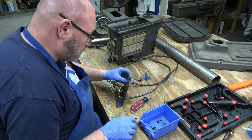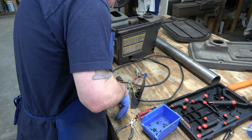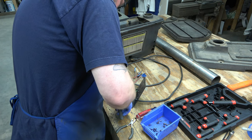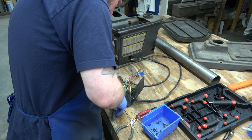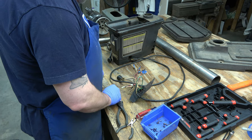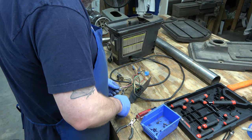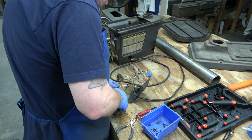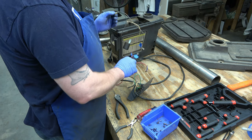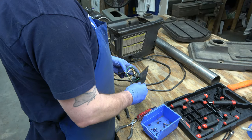There was a washer that I needed to knock loose. To really disassemble it any further, I had to cut off these crimped-on terminal covers, which I'm doing with a pair of dikes. But again, if you don't have to do this, don't do this. If you're going to repaint it and really rebuild this drill press, then have at it. Just make sure you've got those pictures so you can put it all back together, because it's a hot mess of wires and if you get one wrong, things aren't going to work right.